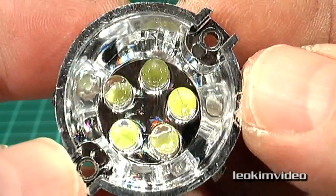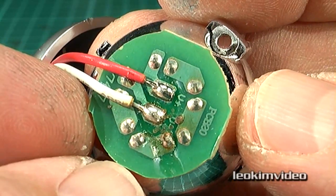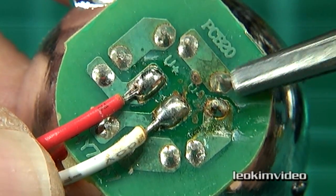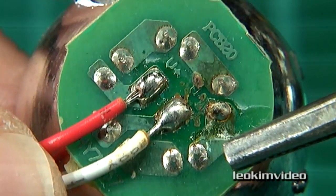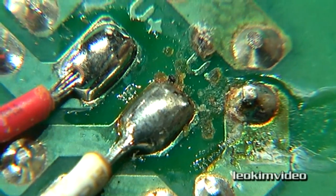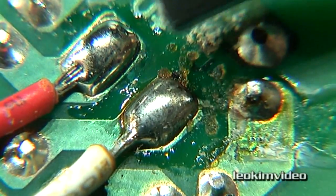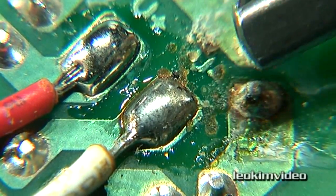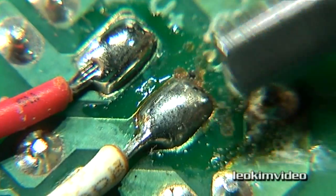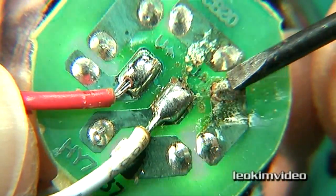There's the array of five LEDs, and there's a small circuit board behind which connects all of these LEDs up to the low voltage power. Here's the back of the light — the power comes in here and the legs from each LED are represented here. There are no resistors in this circuit that I can see, but remember I'm also a bit of a dum-dum at electronics. Looking really closely at that little circuit, there's some gooby gunk there which I don't know what it is — it's soft. Some stuff has gone on here; I don't know whether that's flux or what. This is the flashing strobing light — maybe if I turn it on and have a bit of a prod around we can see where the problem is coming from. As you can see the light is on and still doing its strobing and messing about, and I just don't like the look of what's going on here.